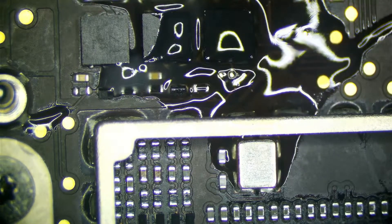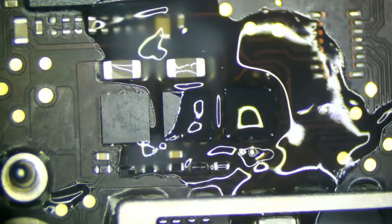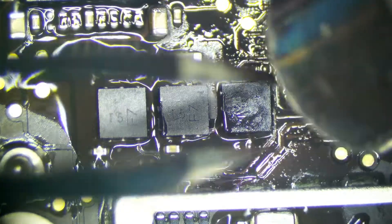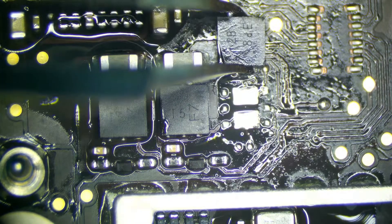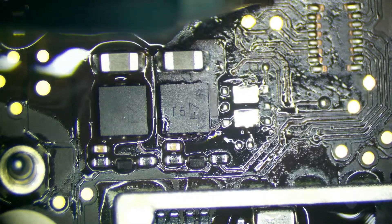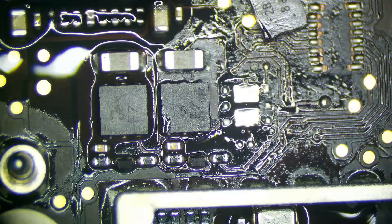The reason I'm moving the iron back and forth is there's still corrosion on those pads and I do not want to solder on top of corrosion. Once it's cleared, I'll go ahead and remove this one. Blowing the air away from the CD because I do not want to float it. Take note of orientation here — looks like it's going this way. Let me go find a compatible replacement.